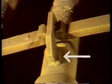The final problem concerning metal components is leakage. And remember, right now, we're talking about inspection with the boiler depressurized, so you might not see the leakage. However, any evidence of leakage should be noted, and the source of the leak determined. This may require some very careful investigation. But one way to detect leaks when the boiler is shut down is to use compressed air to pressurize the superheater. This makes it possible to hear air escaping from any leaks.